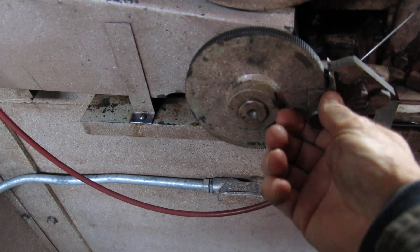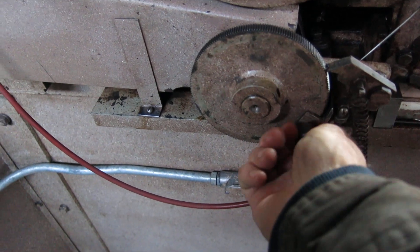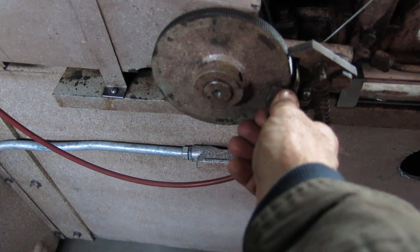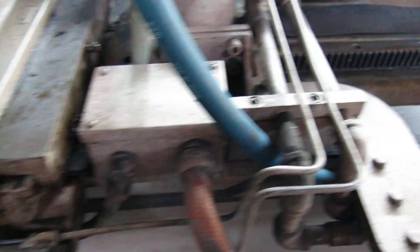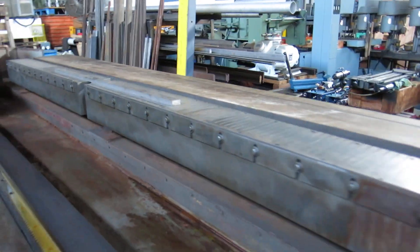This is your stop — this controls how far the feed will travel. When the feed wheel goes up enough it pushes the pawl out of the way and it won't feed anymore. For now we'll just let it feed about ten divisions. We moved the stop in the rear real close so it doesn't have to stroke all the way, just to show you that we have the feed working. It was just a matter of being gummed up.